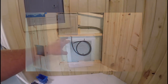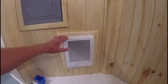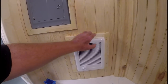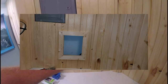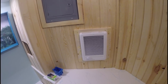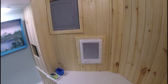The heater mounts in a can that fits into the wall first, then you mount the heater inside the can and attach the grill. The can itself is four inches deep. My paneling here was three and three-quarters inches thick, so I needed a little extra depth. After cutting the hole, I picture-framed it to bring it out far enough so everything worked. It's on its own dedicated circuit and protected by a GFCI breaker for safety, and it didn't cost that much more to do.